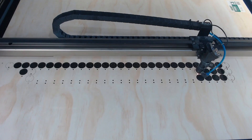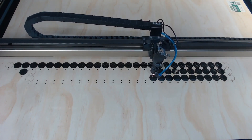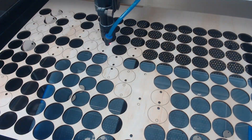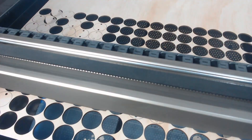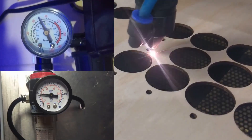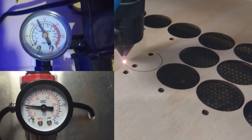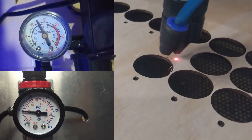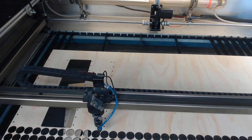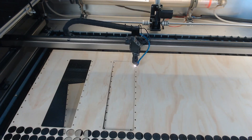Earlier I mentioned selecting an air compressor that can keep up with the type of work you're doing. This compressor is a silenced air compressor with a 50 litre tank. I dialed up the pressure regulator to the laser at 30 psi and the supply from the compressor to approximately 75 psi, then started a 45 minute job. The air compressor kept up without any problems, maintaining a constant 75 psi at the compressor and 30 psi to the nozzle from the regulator. I was very impressed with the results — the cuts were extremely clean, I didn't have to clean any of the parts, and the air compressor made a huge difference.